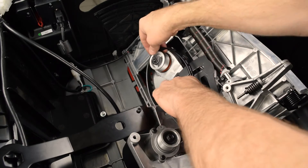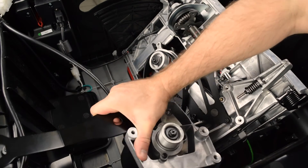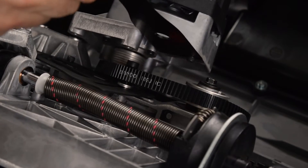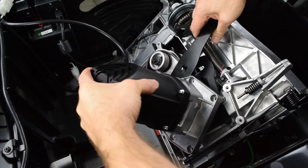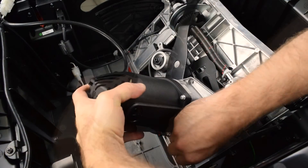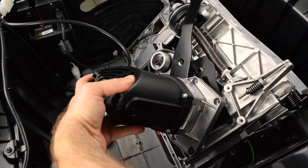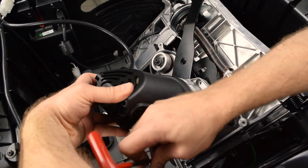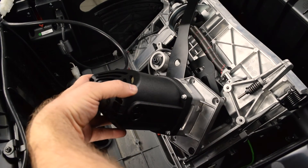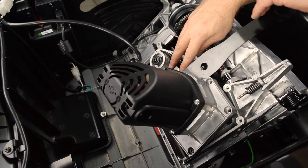Place the new belt over the arbor pulley and the retraction bolt. Place the motor, making sure the motor pulley is on the inside of the belt. Hook the belt with the motor pulley. Reinstall one of the motor mount cap screws in this location — this cap screw will serve as a pivot when you tighten the belt. Leave the cap screw seated but loose; do not yet tighten. Make sure the belt is correctly seated: all the grooves in the pulleys should be covered by all the ribs on the belt.